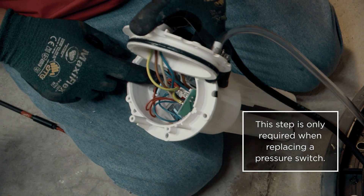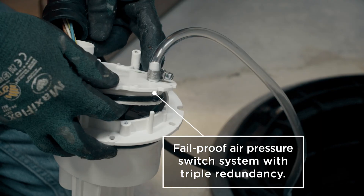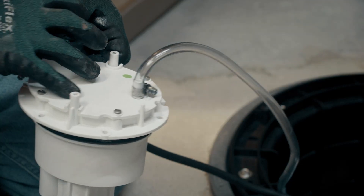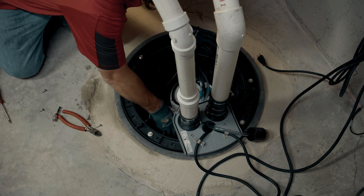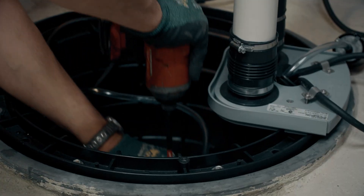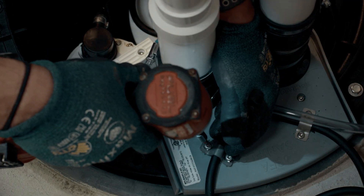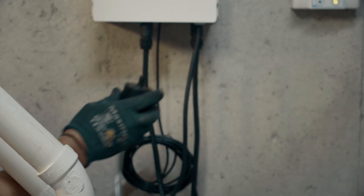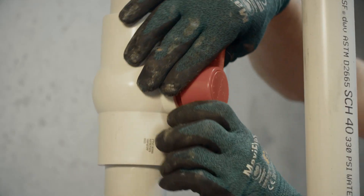Pull this off and you can get to your sensors from under here. After you've fixed whatever sensor you need to fix, put the cover back on, put your screws back in, put your electrical cover back on, tighten the band down, reinstall it, put your handle back in, and reinstall your outer screws. Now tighten down this cable to leave it in the pit for future service. Pull your clear tube back out, plug it back into the unit, put the alarm back in, open up the valve and test.